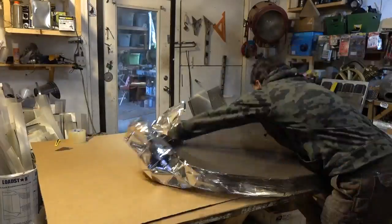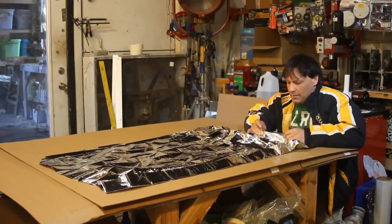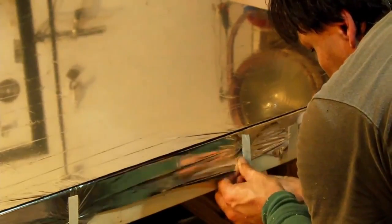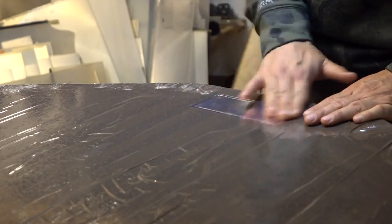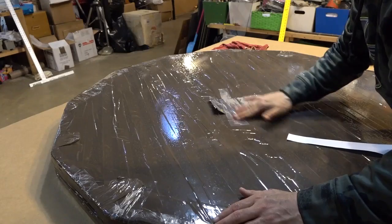The front side of the mirror is a large reflective mylar blanket with the first surface side facing inward. If you watched the previous video, I show you some easy ways to determine which side is the first surface side and instructions to the stretching process. Once completed, a small tape valve is placed in the back, allowing for the optional vacuum application.